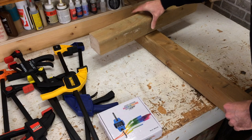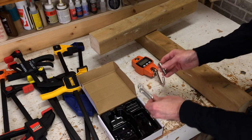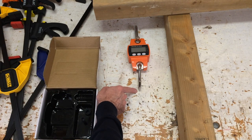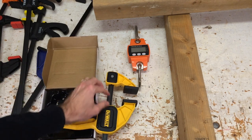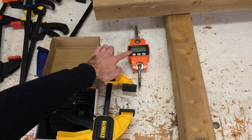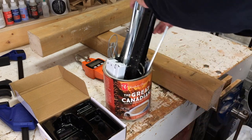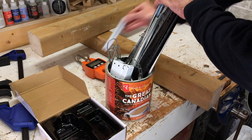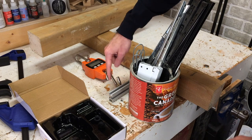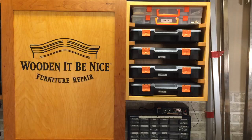And then I need to hook up the scale — so this goes on here and up here. I need some sort of eye bolt to connect that, and down here I need to make a platform so the clamp can come down here. I'll need another brace across here for an anchor point, and that way I can measure the pressure the clamp is exerting on the scale. I keep scrap metal around because it's handy when inventing things. I can use that piece here, and then I need some eye bolts and something to connect the two parts — this suspended ceiling piece should be good and strong. I just need some eye bolts and I should be good to go.